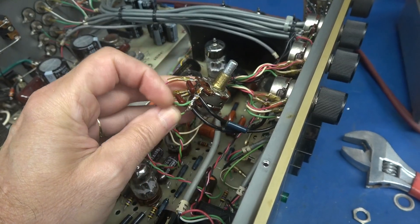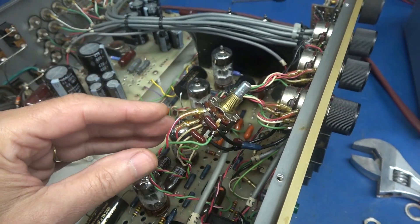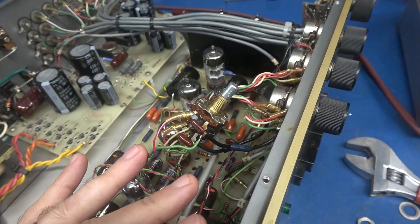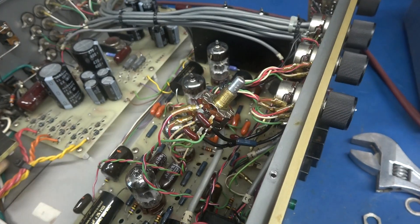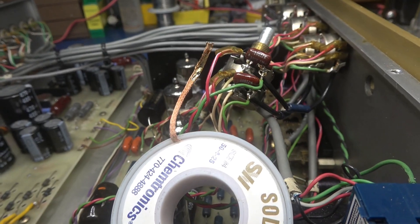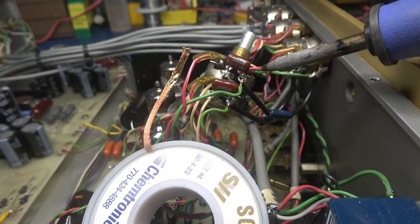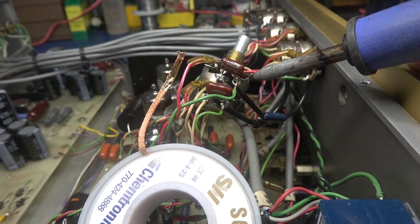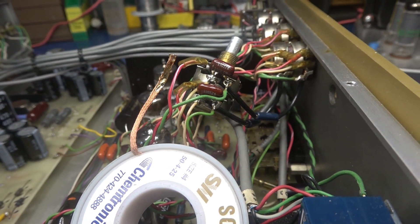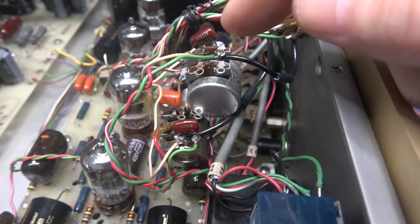Here's the pot pulled from the front panel. You can see we've got a couple of resistors feeding two terminals, and mica caps going to the center. My plan is to take the other pot and move these wires one at a time from the old one to the new one to ensure accurate installation. I'm using Chemtronics solder wick to desolder the terminals, then I'll use an X-Acto knife to bend the wires so I can remove and shift them over onto the new potentiometer.